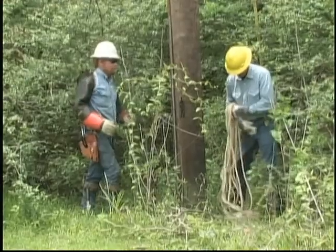The final planning consideration we'll look at is selecting the proper equipment to do the job. If you're lifting heavy components, this involves choosing the types of blocks and sizes of ropes that have the capacity of handling the load. We'll spend more time looking at choosing equipment later in the program. Right now, let's go on to consider the next element of safe rigging, inspecting the equipment.